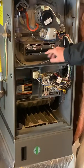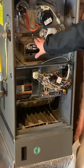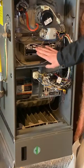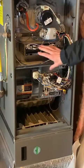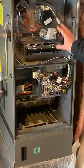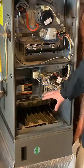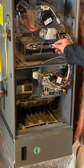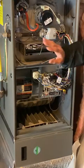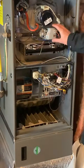Moving to the front of the burner box, we have these white plugs here — there's a pair in the back as well. These are all high temperature sensors, making sure the furnace is not getting too hot. These are safety features. Various situations can arise: the gas could be too high, your blower motor might fail. If any of these things happen, these temperature sensors are supposed to recognize the furnace is too hot and shut down furnace operation.